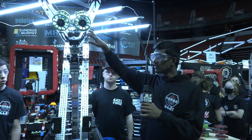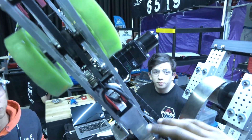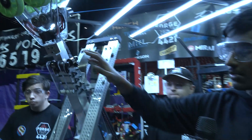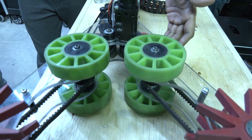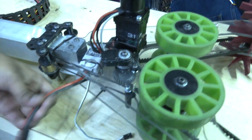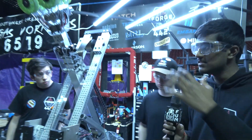We're running a NEO 550 with a Spark on this. Our entire robot only has brushless motors this year. We're running a NEO 550 with a 21-to-1 on an intake that no longer has a hinge — for the first regional we had a hinge but it was causing more problems than it helped, so we removed it. Looking at the internals, we have a cable guide and support on a small 3/8 hex shaft. The Spark feeds up through there and uses cable chain to run down to the base of the robot.